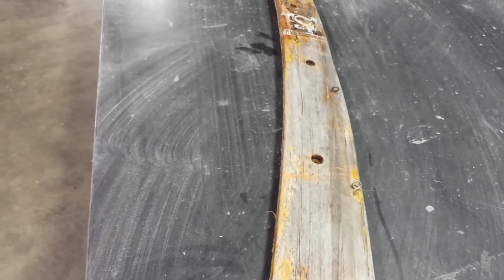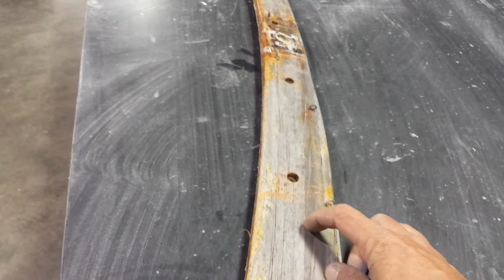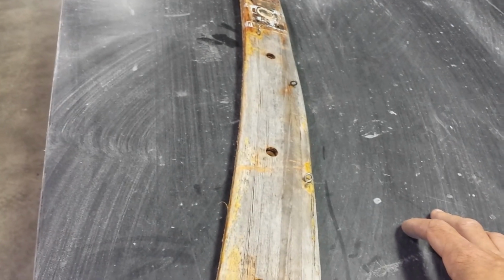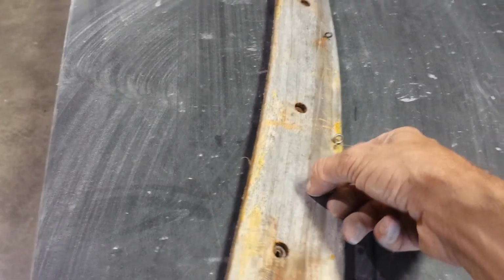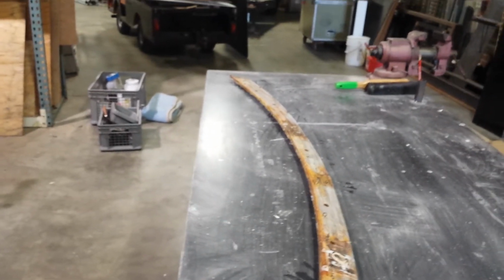And those lines, if I don't keep this teak oiled, those lines will be issues for UV. So it's important that if you do this, if you're going to oil your teak and you're not going to urethane it or varnish it, that you keep up on the oil. Like you can see this old varnish is all worn out. That's UV damage. Once UV gets into the varnish between the cracks, it'll start to work its way down. It's going to happen really slowly, but just keep a good coat of varnish on it. If you're going to do oil, I'm going back with oil, so I'm going to have to make sure that I keep my oil up to date. Otherwise, this material could get some UV damage and then start damaging my glue joints. So I'll have to be aware of that, but that's the choice I'm making. I can always go back and varnish it later if I decide to.